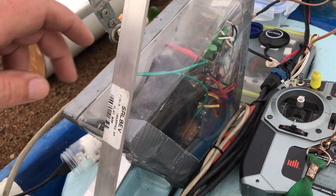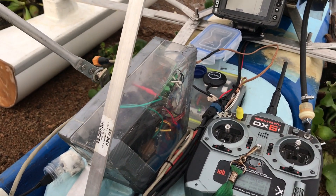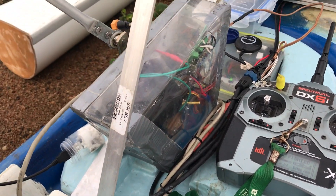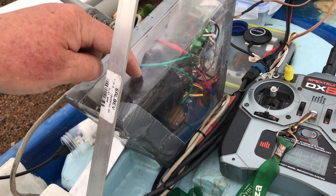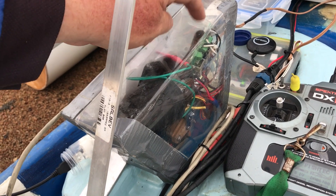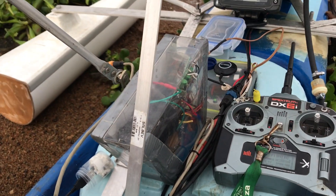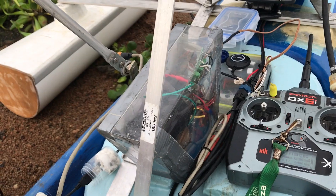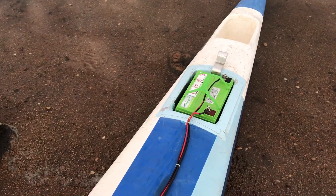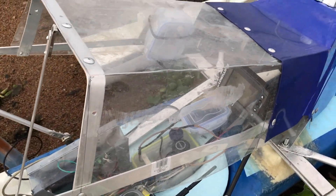This big box with the steering arm — this is essentially like those tiny servo motors you find on radio control boats and cars, but a heavy-duty version. This is a Toyota Hilux wiper motor. We've got a 45-amp H-bridge, a universal steering link. This motor could probably steer up to a 25 or 30 horsepower motor no problem. You've got your power supply on the front — a little Discover 33 amp-hour battery. What an absolutely phenomenal little battery.